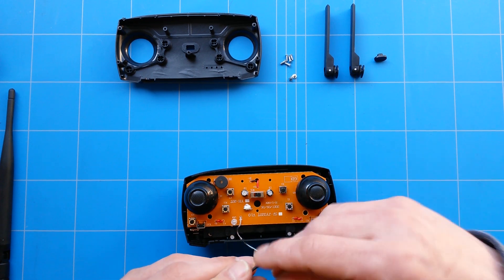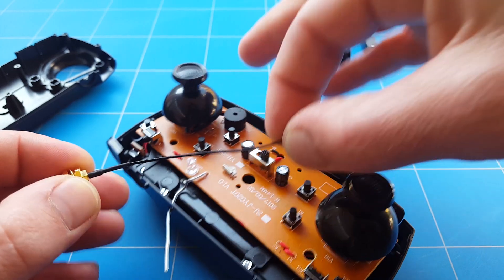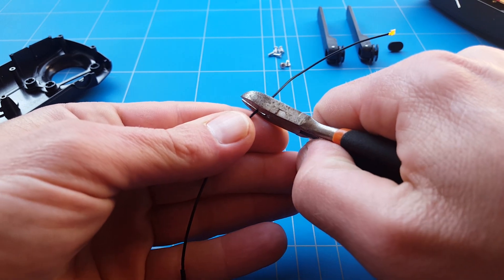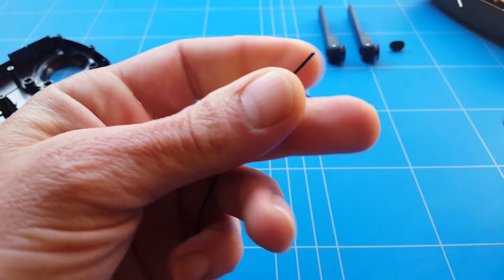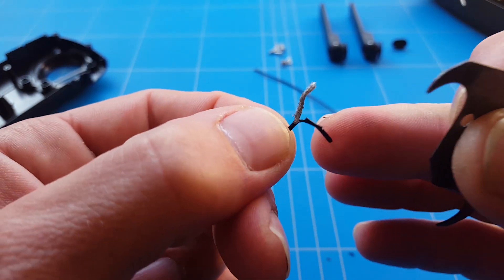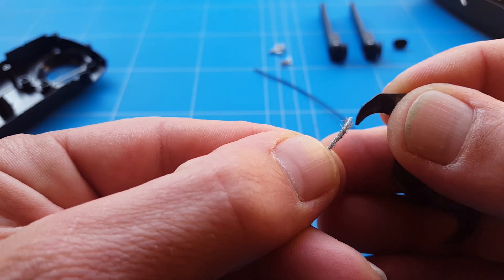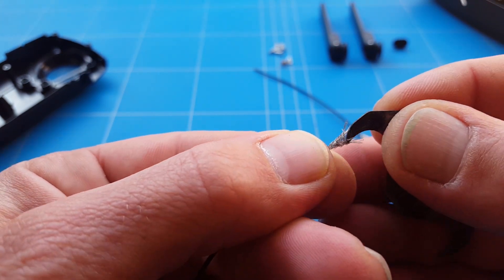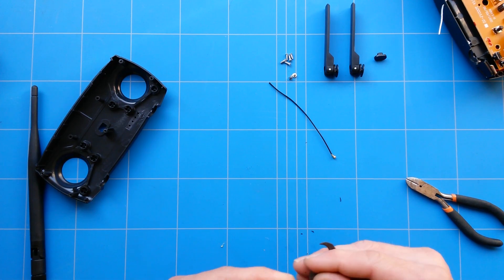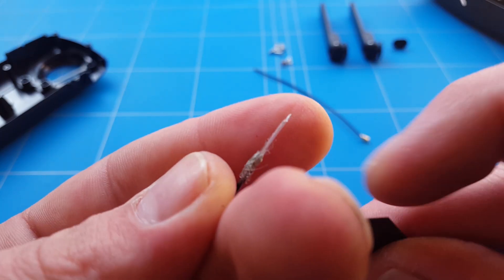Let me put the antenna on top. If you have more space you can put it above the circuit board. Now we can use a lot of extra length — you never know when you have to use it. So let's cut the wire in half and open them up to free up the inner and outer cables. You cut it in half, remove the outside wire for about an inch, then peel back the outside wires. The positive wire is the one inside the little plastic, and you just have to open it a little bit — just the tip. It's difficult to see but we have stripped just the tip of the positive wire.